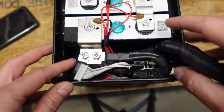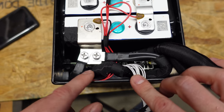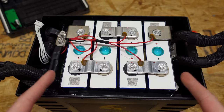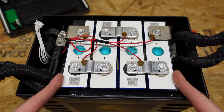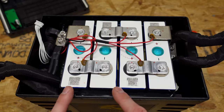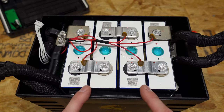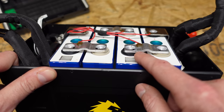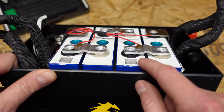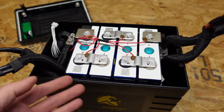I can't really get a good shot of the BMS because it is tucked down in there. I am able to pull it up and down since I broke free the silicone on each side, but it's not going to clear this bracket here. One thing I find most interesting about this setup is that there's no compression on these aluminum-cased prismatic cells — there's no strap around them, there's nothing at all. They have them spaced approximately three to four millimeters apart, and there's no padding in between them, but there is some kind of yellow glue down in there. So I guess they anticipate these expanding a little bit under normal use. The bus bars connecting the series connections kind of hump up a little bit — this is to allow for expansion between the cells, which reduces the stress being put on the terminals if these were to expand. All in all, the build quality does appear to be superior. I have no complaints whatsoever.